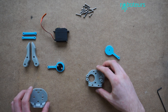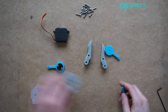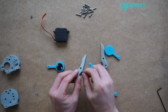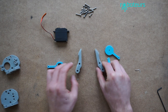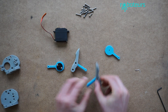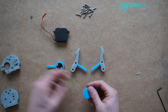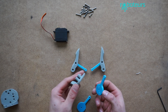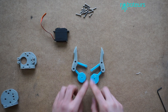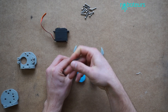The next thing we want to do is put the links and attach them all to the fingers themselves. The links are going to be going on top — you'll have to make sure that all of the support material has been removed; these ones have just been quite freshly printed. These are going to be going on the back here. Generally with the nut traps we always keep them facing down, because we don't want them visible — we just want the tops of the screws visible. We want to start with the 16mm M3s and screw those in all the way.